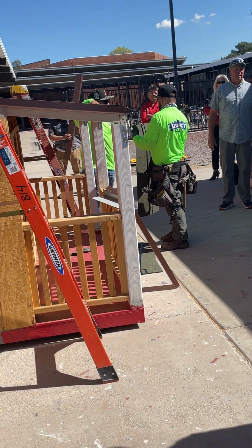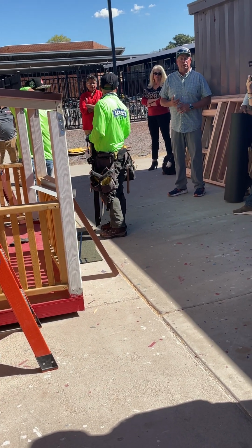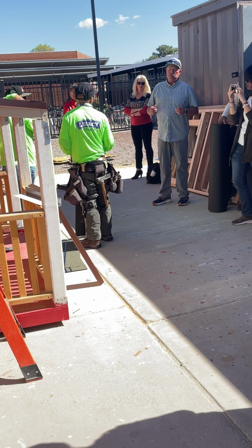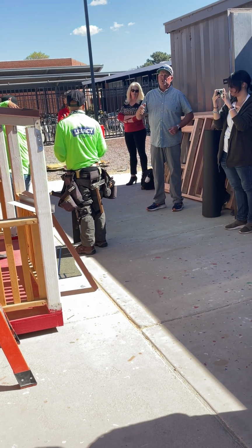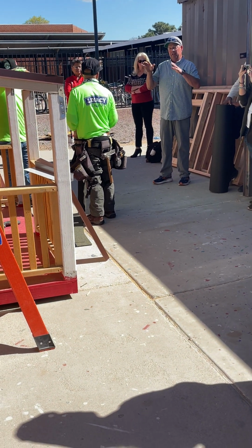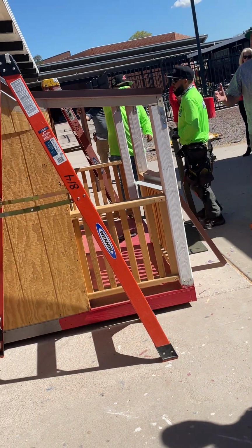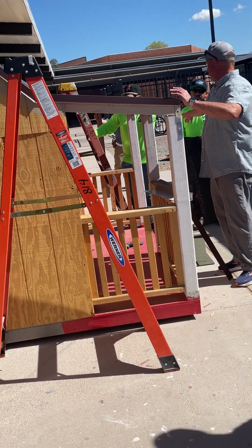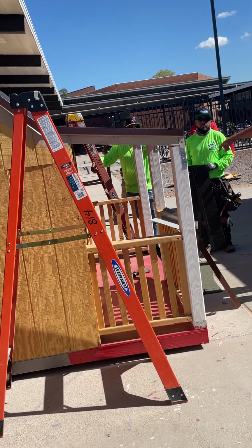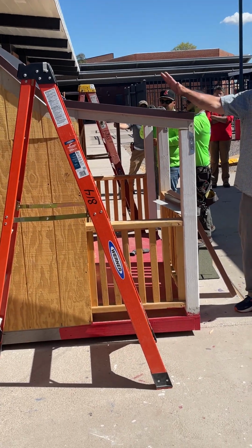And now we want to start to roof, and building code and manufacturer's requirements for a shingle roof are to use a starter shingle. The purpose of the starter shingle is actually to provide an offset at the eave so that as water makes its way down the roof, you don't want an alignment of the shingles. So this is a layer of protection, because once we put the shingles on, we're going to have an offset with the starter piece so that water does not find its way underneath the metal right here, okay? So we're going to start with that starter shingle, and we install it on both the eave, and this is what we call the rake, okay?